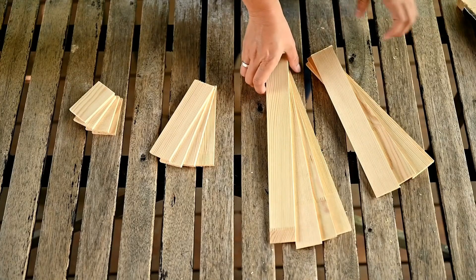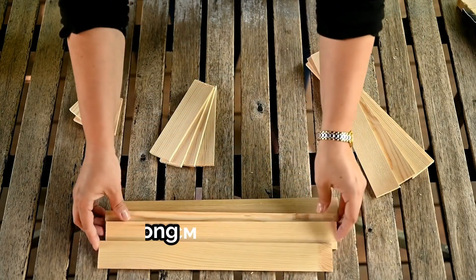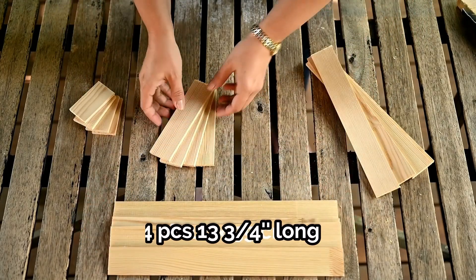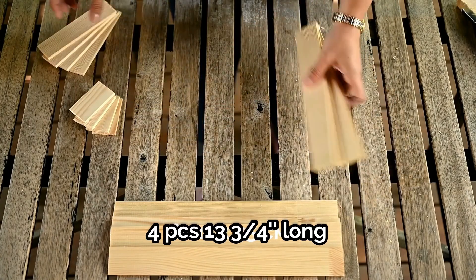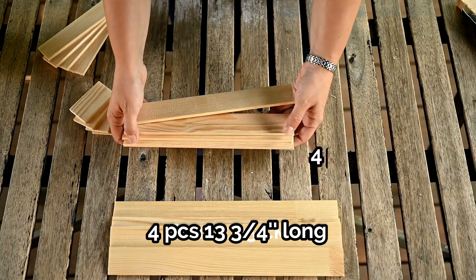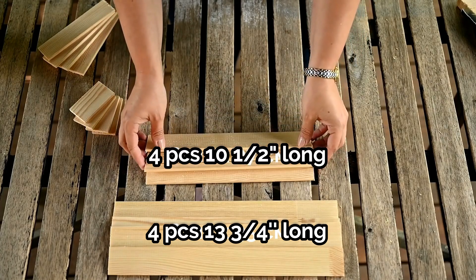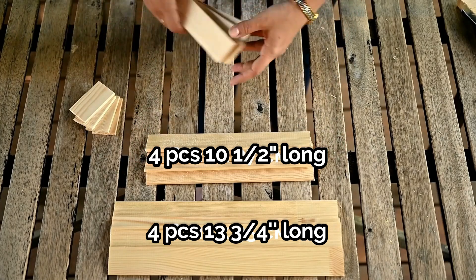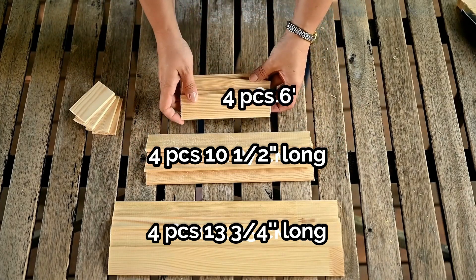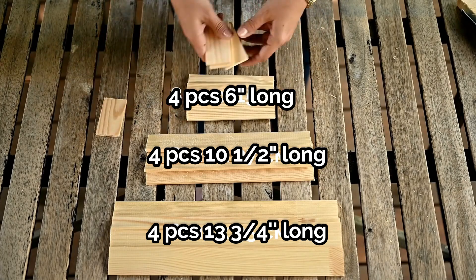The second organizer is inspired by drawers with chicken wire inserts that I came across on Pinterest. First of all I'll assemble the front and back panels — I'm making them out of thin planks one and five eighths inches wide. I'm cutting the planks into pieces of thirteen and three quarters, ten and a half, six, and two and three quarter inches. You want to make two pieces of each size for the two drawers.